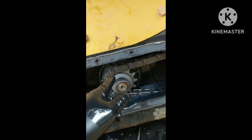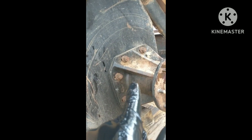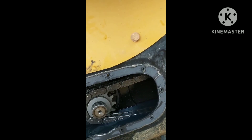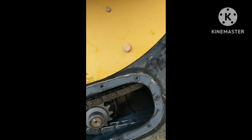I'm going to take this last chain off. One thing I forgot to mention — this back chain here: what I do to keep from having to cut it is I'll take the rest of the bolts loose on the axle stub, take the nuts off, pull the axle stub out and just pull it forward some — take it completely off the studs and pull it forward. By doing that, it'll allow that chain to get enough slack where you can pull it completely off the rest of that sprocket. Then you can just set it back on a handful of bolts or nuts and put the stub back on as a placeholder.